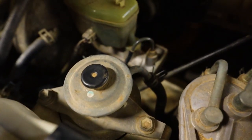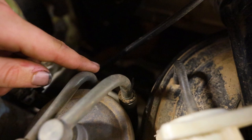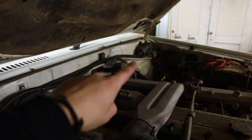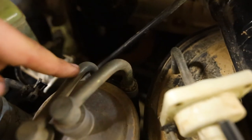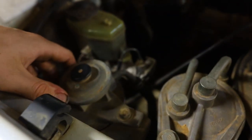It shouldn't be too hard. This is the first fuel filter and this is the second one. This one here is the in, this is the out. Pretty much I'll disconnect that, run extra hose up and along the back into the fuel water separator, and then run it back in, which will run through this filter and then into this filter. So we are going to have fuel filters for days, which is perfectly fine, especially with a diesel.